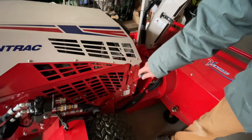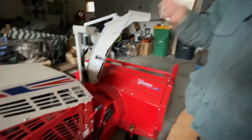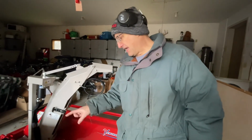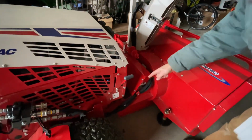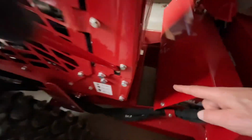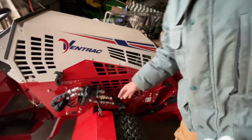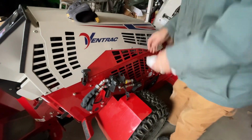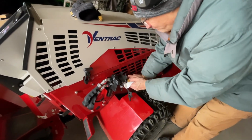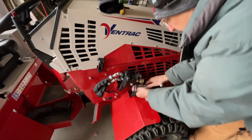It's this. And this is the PTO belt, because this tractor doesn't have a mechanical PTO. It has a pulley and belt system. So this releases the tension on the belt, and you can see that I've loosened that belt right here. Used to be on here, now it's here. So that's the first step. Then I think the second step is to detach the hydraulics. That's why I have my paper towel, because why dribble on your shiny new gizmo? There's one.